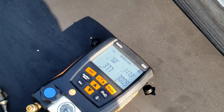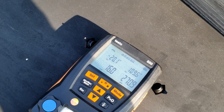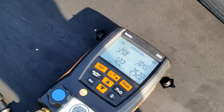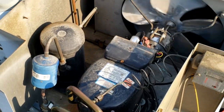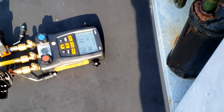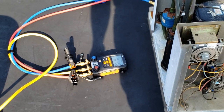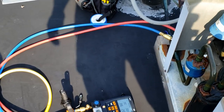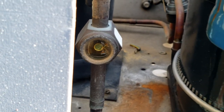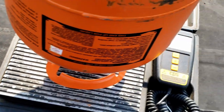Let's see if it can pump down. It's going down — yeah, the TXV, I think it's got some problems. Now that we've condensed everything into the receiver, let's see how it acts now. Oh, that's fast — the TXV really doesn't look good. We'll have to watch this for a little bit. It might just be because it's warm down there, but it really seems higher than normal. We just cleared the sight glass — we're going to watch that for a while. Running about 321 on the head pressure, and it's only about 75 to 80 degrees outside.